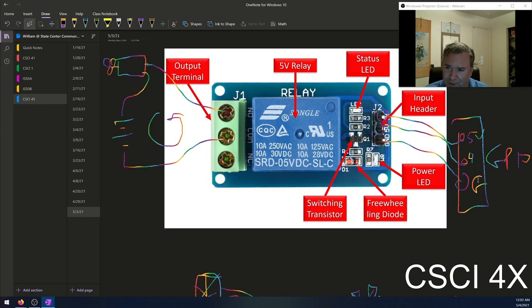You've also got one or two PWM wires that can be used to control DC motors faster or slower. So if you do PWM out, you can turn LEDs on brighter or dimmer, run a DC motor faster or slower by doing PWM, which is going to simulate an analog output. It's not really analog, it's just digital turning on and off really fast.